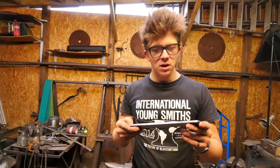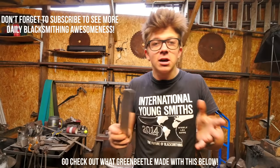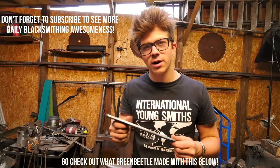I'm going to etch it in ferric chloride, and it's probably going to be like a 1-3 dilution, nice little slow etch, purely for the reason of Greenbeetle being able to identify the pattern that's there and work with it as he does it.